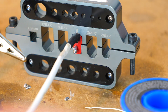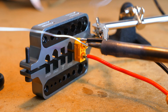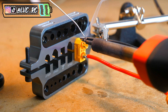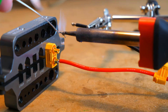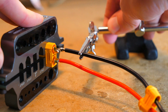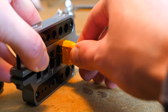To ensure this is going to hold up long term, you can check by pulling on the wire and adding some tension to see if it breaks off. If you're using lead solder, make sure your joints are nice and shiny — if they're cloudy or dull, the solder was too cold and it's probably not going to hold up. With lead-free solder, your joints will usually not look very shiny. If you hold your soldering iron on the wire and plug for too long, you're going to end up melting the plastic around the tabs on your plug. To avoid this, you can grab a spare opposite connector and plug it in so if the plastic does melt a little, the tabs will stay in place.